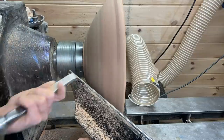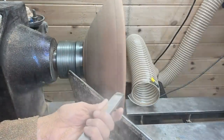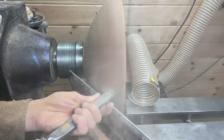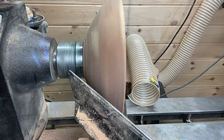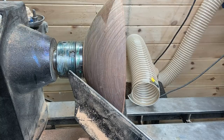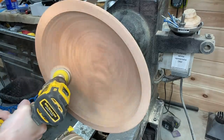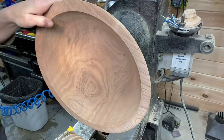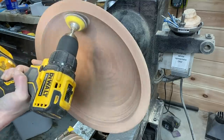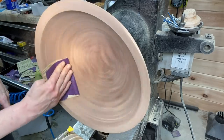Here I'm just trying to work on the bottom of the bowl, getting it in balance — it was still slightly out of balance here. You'll notice in a second when I turn off the lathe. It's still out of balance because as I was turning it, it was cutting in places and not in other places. Here I start sanding with 80 grit with some power sanding, and then some more 80 grit with hand sanding.